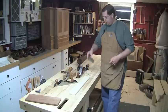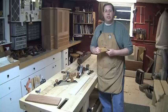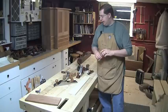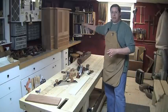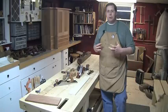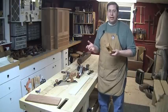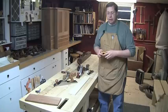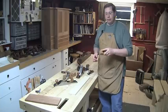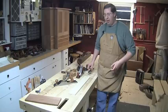Something like a block plane — whether it's a rabbeting version or a traditional wooden block plane — can be a really useful tool to have around. It's used for making chamfers, breaking edges on your projects, getting into small areas, removing tearout, or smoothing a finish down. All the rails and stiles in a cabinet door, all the drawer blades — tiny pieces anywhere from seven-eighths to an inch and a half across — hitting them with a block plane is really great. You can smooth them, flatten them, get them ready for finish using this tiny plane that fits in the palm of one hand. If all you're doing is working on a piece that's three inches wide and five inches long, the block plane may be all you need.